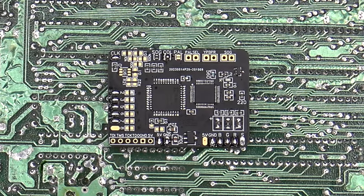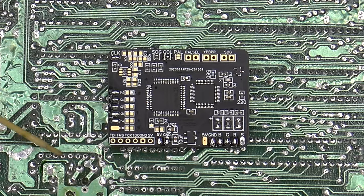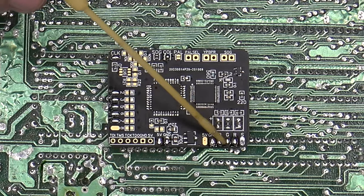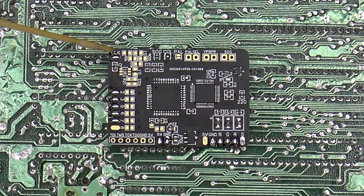Just like that. So from here, all that's left to do is to get some wire and trim it up as needed, and solder from the input points here on the board and attach them where they need to go on U10 along the chip's side here, and then get some wires ready for my output lines. Additionally, of course, I'll need to solder in my 5-volt and ground for the board to operate on, and another wire for the clock pin here.